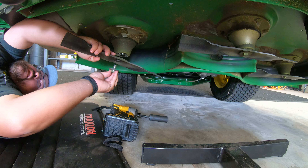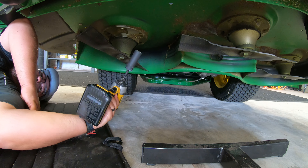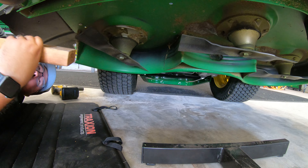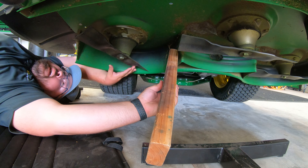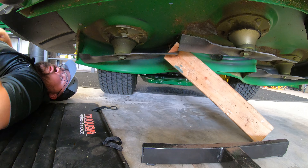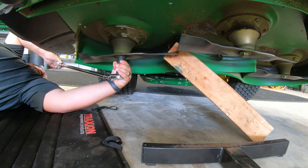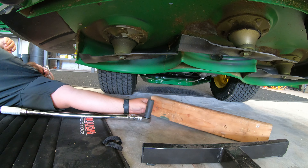Then we take our new blade, go back on, and start that up by hand. A lot of people are going to say just hammer it back down with your impact, but you want to make sure that you're getting the right amount of torque on these bolts — this is why I highly recommend using that torque wrench and that block of wood to make sure these are done correctly. Get your blade spun around to where it is making contact and pinned in, then take your torque wrench, make sure it is set to 50 foot pounds, and tighten that up till we hear the click — 50 foot pounds. Then move the blade, let the wood drop out, and get everything out from underneath.